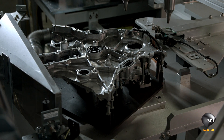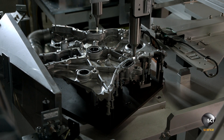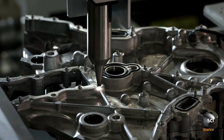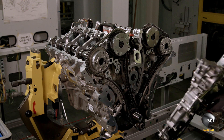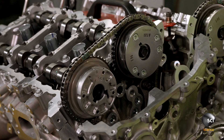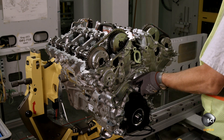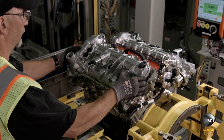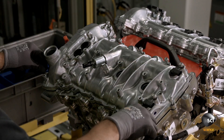A high-tech device now applies a plasma treatment to the engine's front cover. The plasma treatment simultaneously cleans and electrically charges the surface for better adherence to a specialized sealant. The RTV, or room temperature vulcanization, sealant then goes on the surfaces before a technician installs the cover.